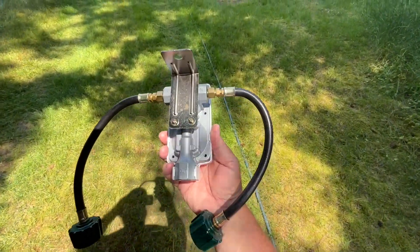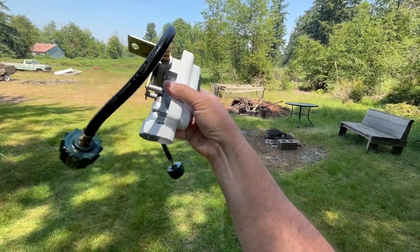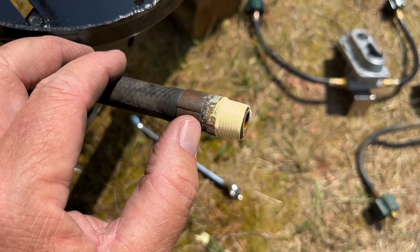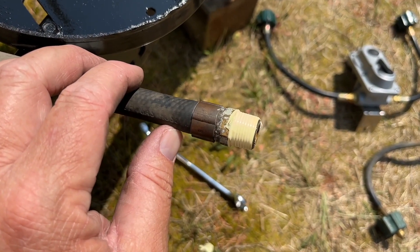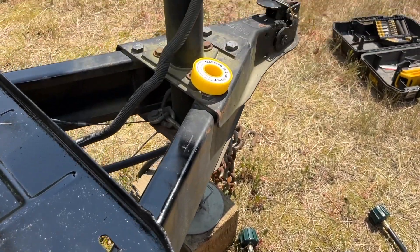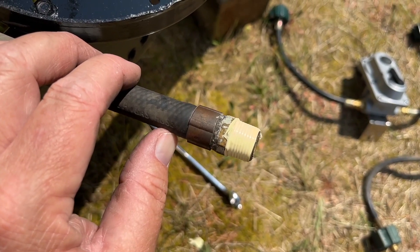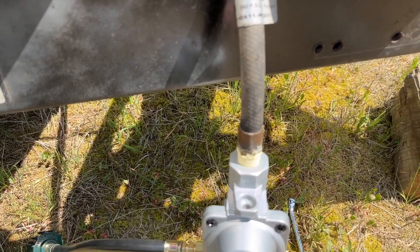Here's my new gas valve. Something you'll notice immediately is that the hoses are all flexible — they're not stiff as a board. I made sure to give this a few good wraps of Teflon tape. If you're wondering why this is yellow — technically yellow is for gas and white is for water plumbing. While they're essentially the same, the difference is the yellow is much thicker. If you don't have yellow on hand, you can use white — just use three times as much. I make sure to get this started by hand so I know I'm not cross-threading anything before I put wrenches to it.